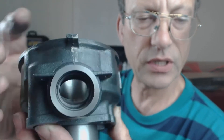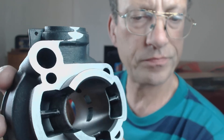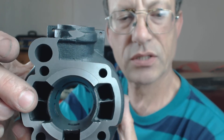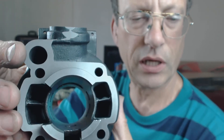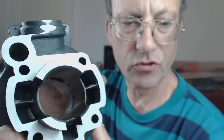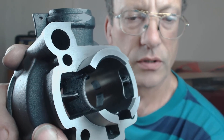And that's been polished a little bit on the inside. And here at the bottom, these struts — these supports — the casting in the middle, which were very big and bulky. What we've done is we've just slimmed the entry points down so that there should be less turbulence. And we've also, as you can see, polished them.